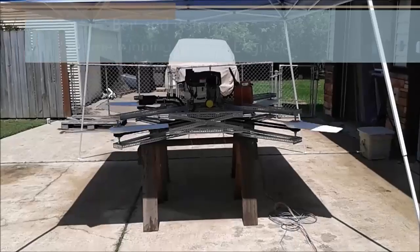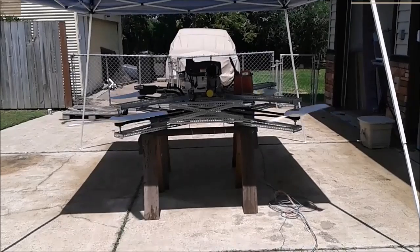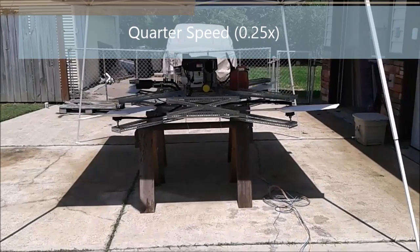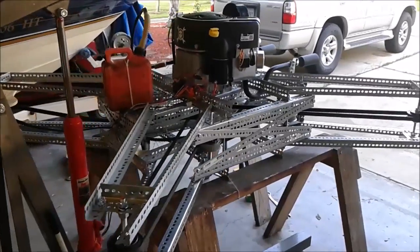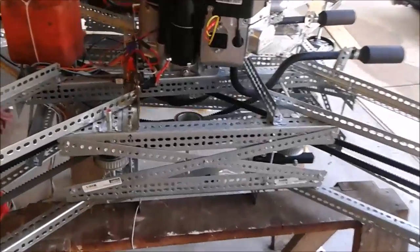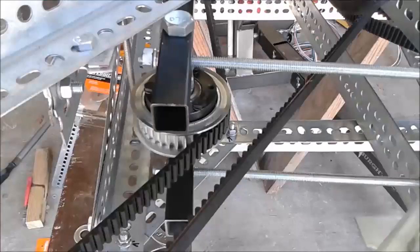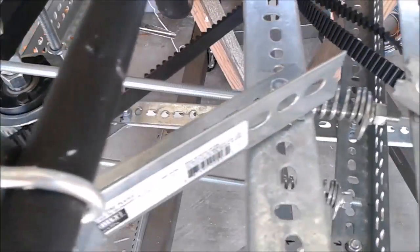After having some difficulty, the engine was started up for the first time in early September. Unfortunately, the belt system developed some slack and two of the propellers were ruined. Since then, Goliath has been undergoing changes to improve the belt system. The belt system has been rerouted and the propeller arms were extended slightly to take up the excess length. New tensioners have also been designed to keep proper tension as the belt stretches.